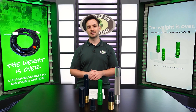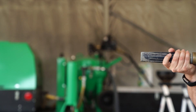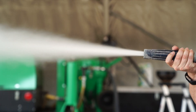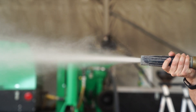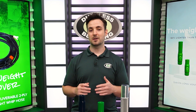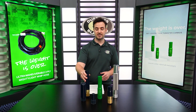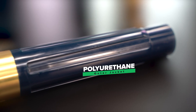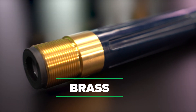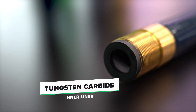Let's start off with the basics. What is a nozzle? What does it do? And what is it made of? A blasting nozzle is something blasters use on the end of a blast hose. The blast nozzle helps focus the stream of media into a certain pattern. Most nozzles are made up of two to three types of materials. Our SLV nozzles have three different materials: the polyurethane outer jacket, the brass threaded collar, and the inner liner made of tungsten carbide.